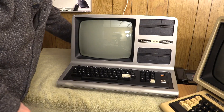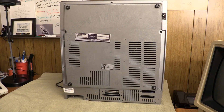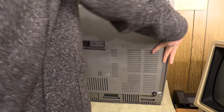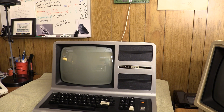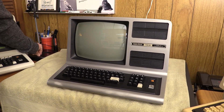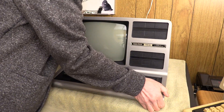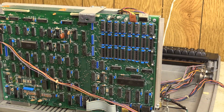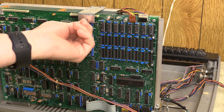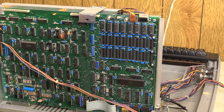Let's get this flipped up and take a look. I'm going to flip this down, holding onto these screws so they don't fall. One did not come out so I have to give it a little finagle. I didn't remove the back screw because it's already removed — I didn't line this quite right when I put it back together last time, so I left the screw out. Now to get this off without wrecking the CRT. The machine's still plugged in so I can ground myself. So these are the sockets here, and we've already got our first 16K of RAM — eight 4116s.